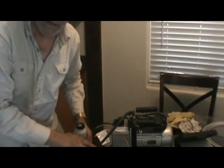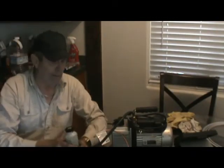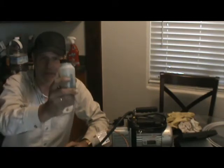And one of the things that I keep mentioning, the other thing, let me say this first. After I evacuate it, what I do is I will put Freon in it, about 50 pounds, and then I'll leak test it with the leak detector. I'll leak test it just as a second test to make sure, if the vacuum didn't catch it, that 50 pounds, and you'll get bubbles right away. It's just like soap. Okay? So if anything comes out of the joint, you're going to get bubbles, and you're going to know the vacuum pump didn't catch it.